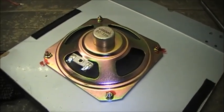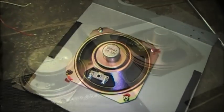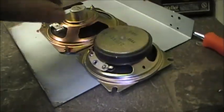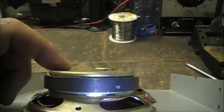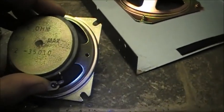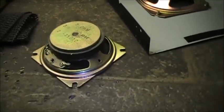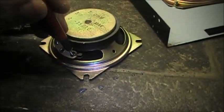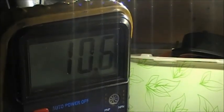I'm going to look in my little speaker collection and see if we've got an 8-ohm speaker that can fit this case cover. I really had to dig down into the pile of speakers. I started looking for an 8-ohm 5-watt speaker, and the closest one I had was an 8-ohm 10-watt speaker. So we're going to check this replacement speaker — putting the probes on the connections — and we do have continuity. So this is a good speaker.